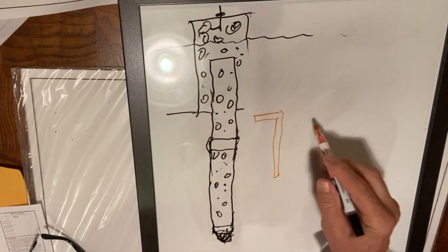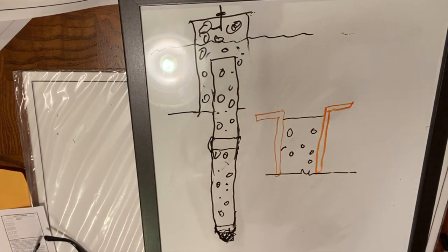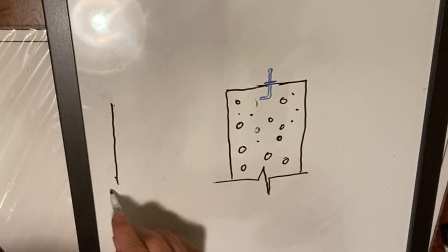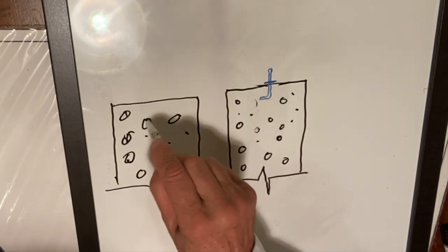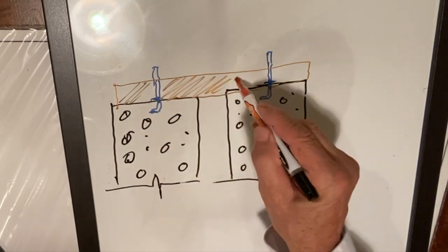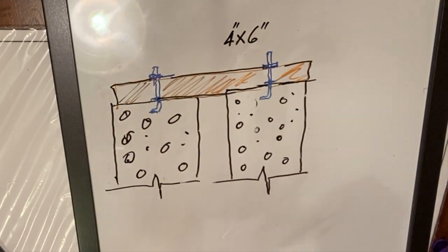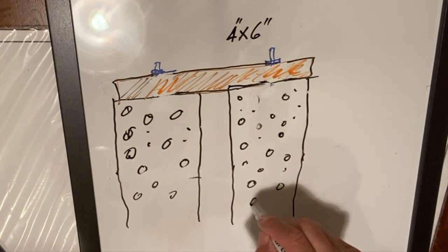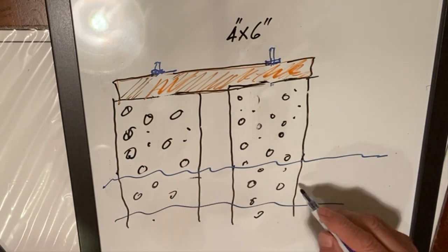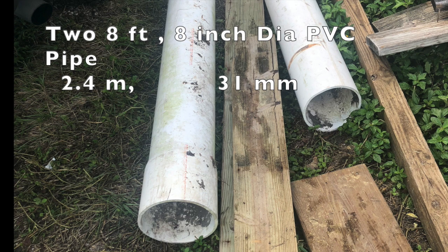Here's an enlargement of the form at the top. Once you have your concrete in, you place an anchor bolt. Remove the form and you basically have a concrete piling that goes all the way down to the seabed. It's best to work in pairs — have a second piling and connect them with a 4x6 pressure-treated wood. The concrete protects you against the low and high watermarks and protects against biological damage.